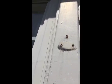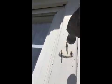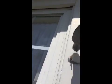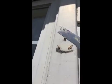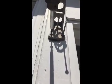Once you have your holes, stick as many toothpicks as you can in the holes. Once you put as many toothpicks in, just hammer them in as far as they go. Flush cut any mess that you have. Drive your screws flush.